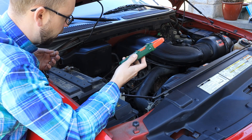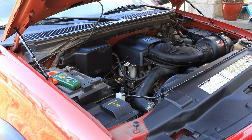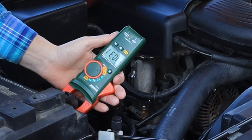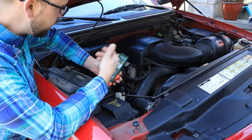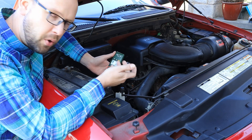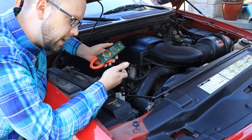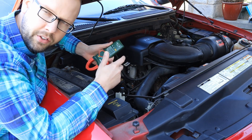I'll start the truck so the coil, fuel pump, and other components will pull much more current. Now we're getting 10.5 amps. I've got electric fans on the truck but they're not on yet. This is super useful because when I pulled these fans from a Ford Explorer at the junkyard, I had no idea how much current they'd pull — there's no documentation on that. I essentially had to figure it out before I could start sizing wires for my system.